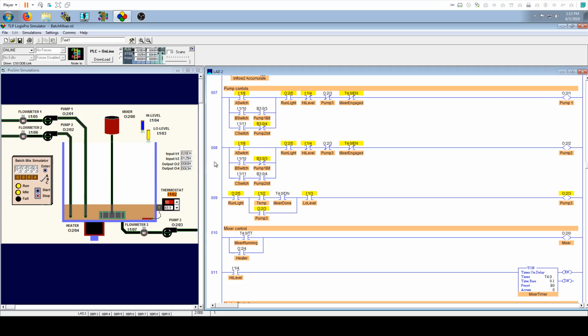So in mode A, like I said, it's just straight through 50/50. And in mode B, what we have here is our virtual bits that we just made up above. So again, when it's less than or equal to the set point, this becomes true, and we activate pump 1. When it's greater than our set point, pump 2 kicks in. And then in mode C, it's just opposite. So we have pump 2 being true until the set point, and then once the set point has been reached, pump 1 kicks in. Okay, so same bit, opposite states. That's how you do that.